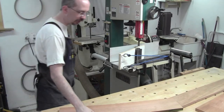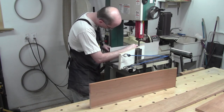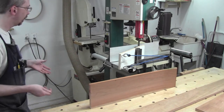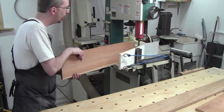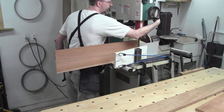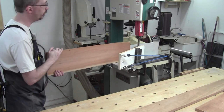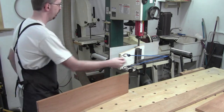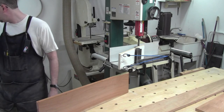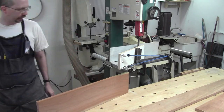We're all set. We've got our cherry and I'm going to slice it this way. I've taken my little brass setup bar — it's an eighth inch thick. It doesn't touch the tooth just yet — it's a very slightly heavy eighth inch. The only thing we've got to do now is push our board through. The bungee opens and grabs onto it and pushes everything down. The name of the game is slow feed rate. Extremely slow feed rate — take your time. I'm going to gear up and try to slice this and see how many I can get out of one thickness.